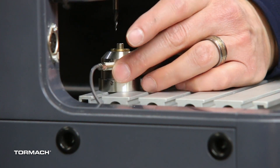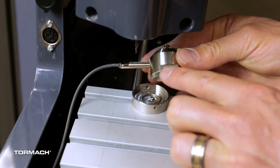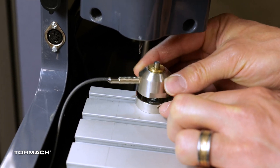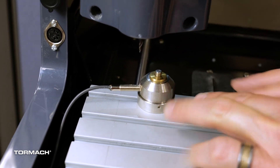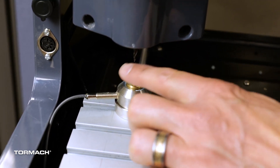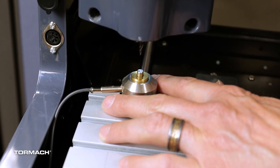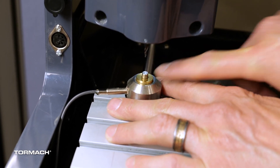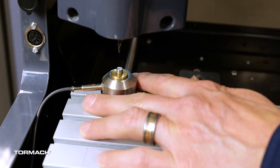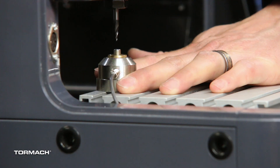Next I'm going to place my probe into the tool holder. You can see that it lines up — you have these machine parts that line up to the machine parts of the tool holder and they should be relatively free, so everything should be moving around at this point. I like that this comes to a very narrow point because what I'm trying to do is line up the point with my tool holder. I'll bring my Z down a little bit lower just to make sure we're close, and that looks good.